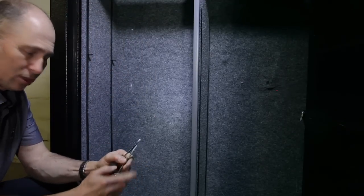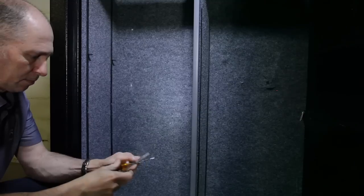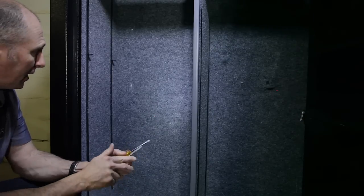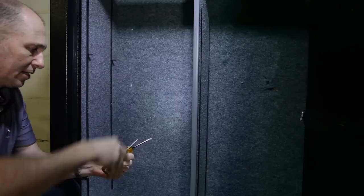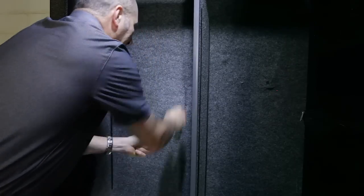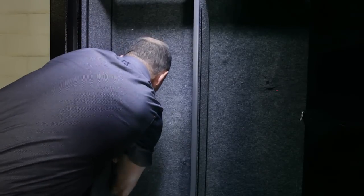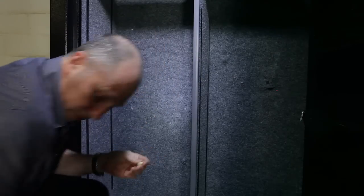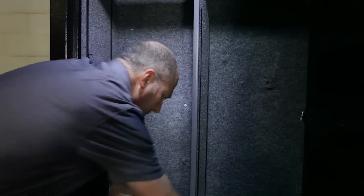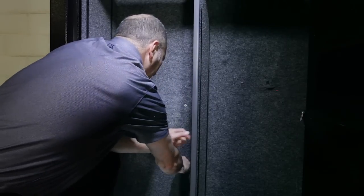Now I've got my holes marked. There are three options: an awl, which you can just punch right through the drywall and wiggle a little to make a pilot hole; a small Phillips head screwdriver; or a small mason bit — though with the mason bit, be careful the carpeting doesn't twirl on the bit and chew it up. I'm going to put this on my mark, just boom, hit it in, wiggle it a little bit. Then I carefully screw the mounts in place. Go slow with this because you can strip these.